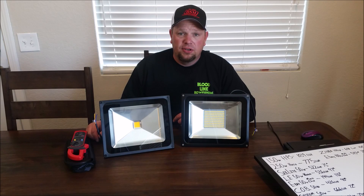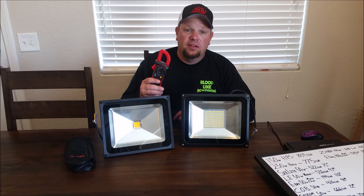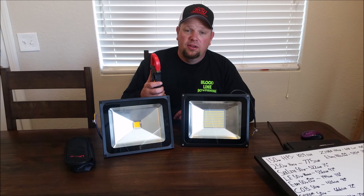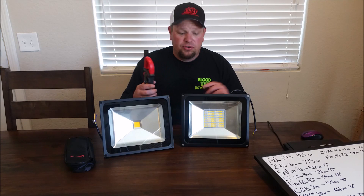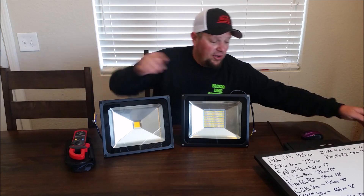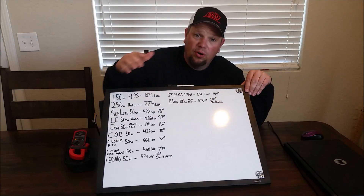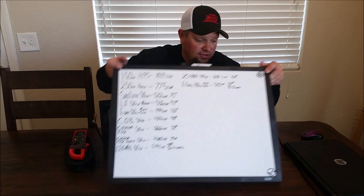I feel like I'd be remiss if I didn't apologize — I have been doing these tests wrong from the start. This amp meter is a game changer. It's going to tell us which light is the most efficient, and since we're running lights off generators, efficiency should be what we strive for. With this amp meter I can determine how many lux per watt every individual light is using, so we can quit arbitrarily calling them 100-watt when this one is really 76, or 50-watt when it's really 56. I'm going to go back and test every light again with the amp meter and update my board.